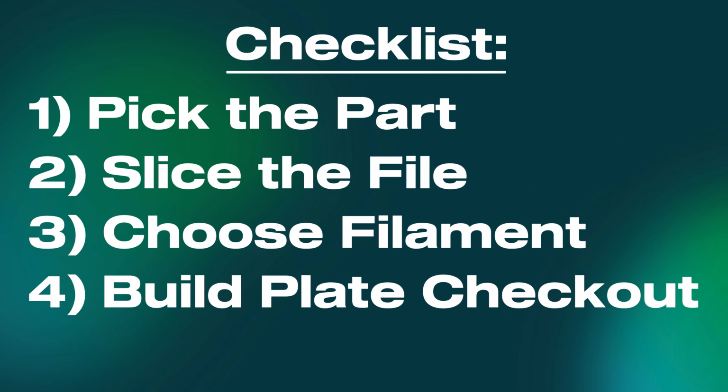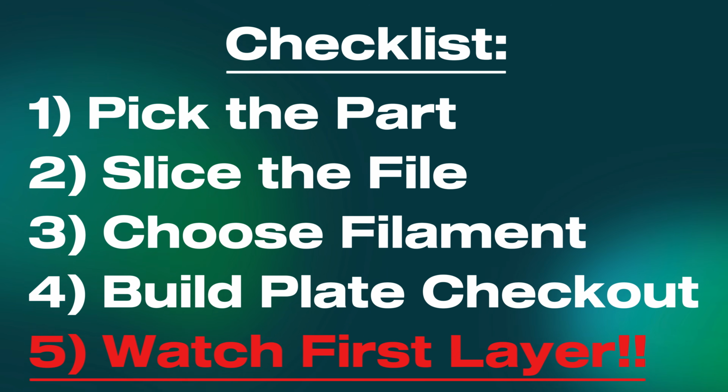So there's nothing on it, it's clean. Give a nice quick visual inspection to your 3D printer to make sure: did it shift? Is there something weird that you haven't paid attention to? Just get your eyes on it really quickly before you start a 3D print. The most critical piece too is watching that first layer go down, if you have a printer that typically is not very good at getting bed adhesion. As a general rule, it's good to watch your first layers go down with a machine, to build your confidence that way. Don't just repeatedly keep sending it to the printer, realizing you have bed adhesion issues, and then ignoring them every time the print starts.